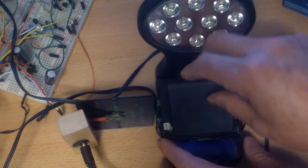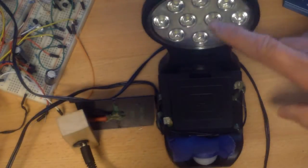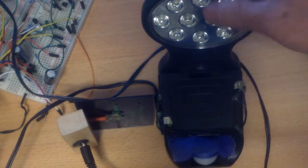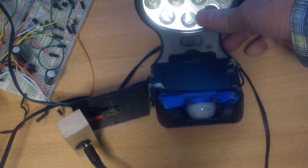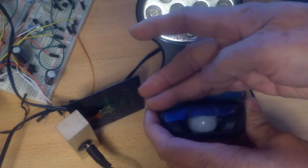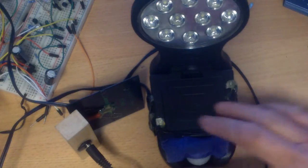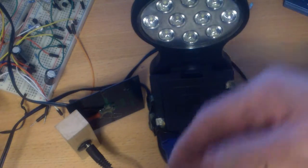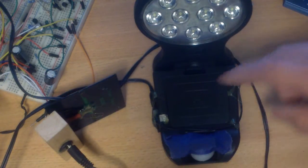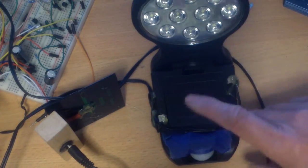If I switch it on, it will light up — it's motion sensing, so it only goes on when someone walks close by it. But like a lot of motion sensing lights, it gives a lot of false alarms. So I cover a big part of the sensor so it won't really go on until you're directly under the light. Otherwise it triggers for every passing car or anything that moves nearby — that's the problem with this kind of light. But it does save battery power.